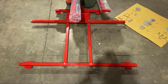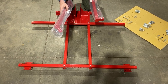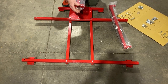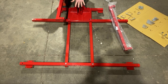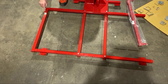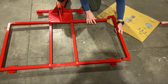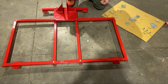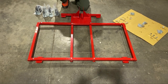We're on step three. This step requires you to make sure you get the side correct. I have HAC-061 and HAC-060 — these line up in a specific order. You can see there's a welded piece on the very end, and that goes farthest away from the large mounting unit. I slide this right in so the tab is toward the back, and do exactly the same with HAC-060. For these four connections we use the 1.75" bolts and four nylock nuts.